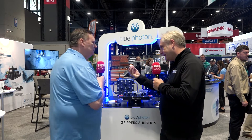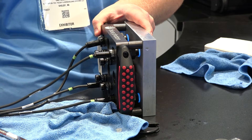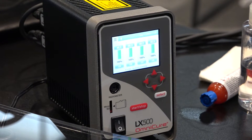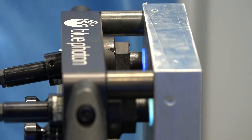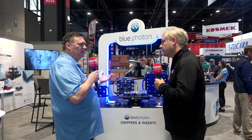There's an LED light coming through the back to cure the glue. What's nice about this is you don't really have a working time once you dispense the adhesive, so you can take your time loading your part. Once exposed to the UV source, it's 60 seconds to solidify and you're ready to go.